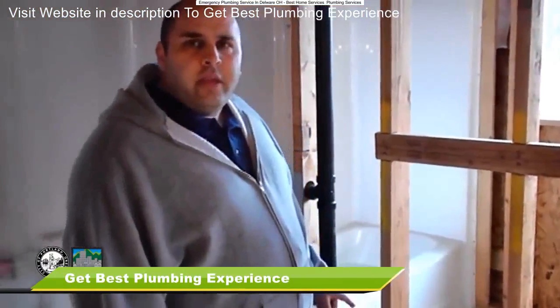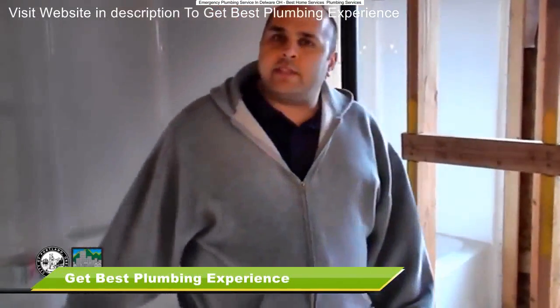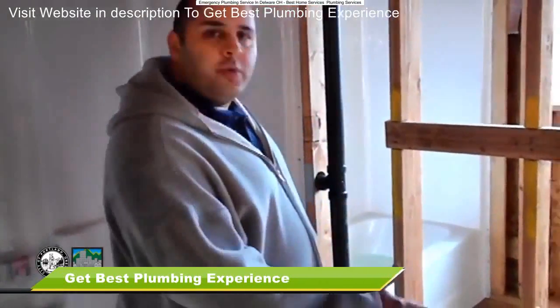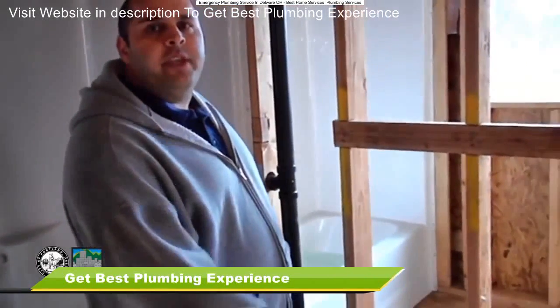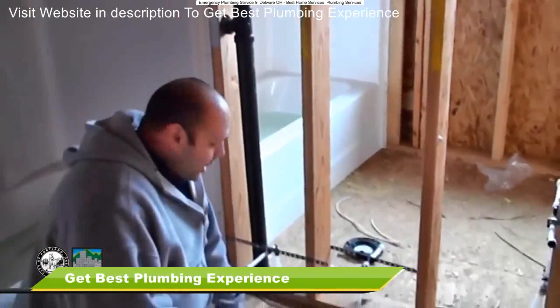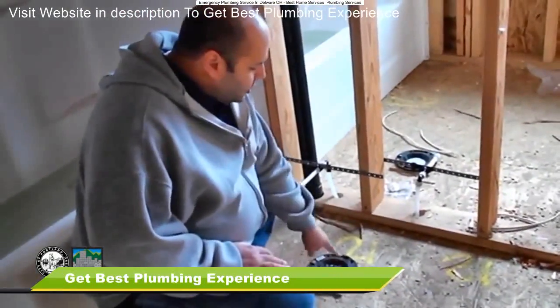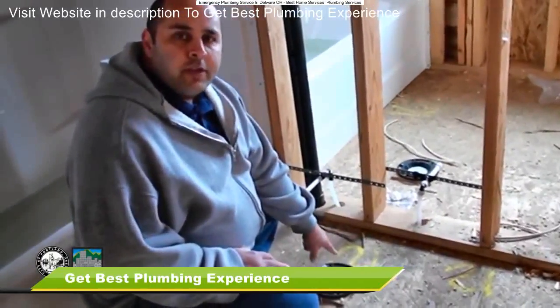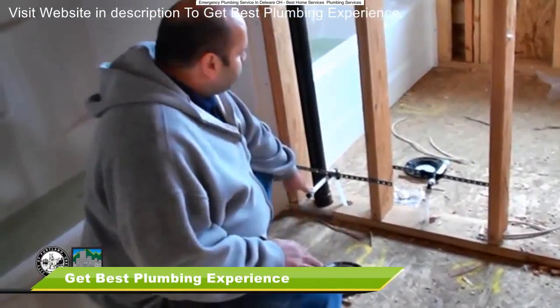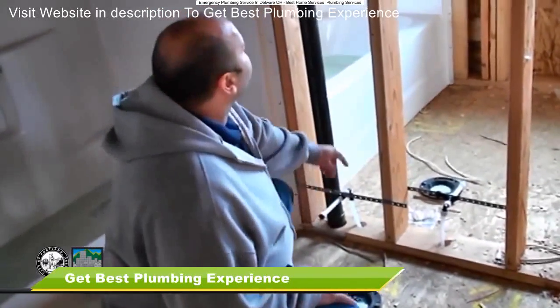We're here in the second floor full bath. This is a full bath because if it has a tub shower with the toilet and the bathroom sink, then we're going to call that a full bath. We're going to start back here again at the flange. We're going to check for our corrosion resistant screws and make sure that all the screw holes are filled. The other thing we're going to do is make sure we have a cold water supply. We've got to be able to supply the toilet.